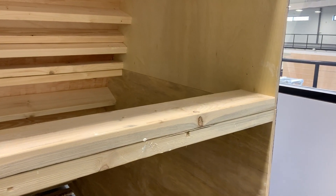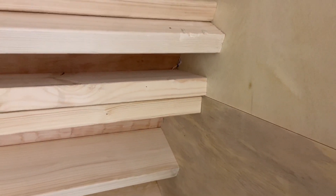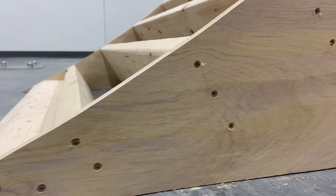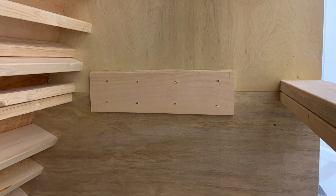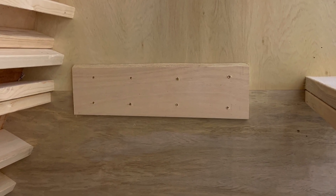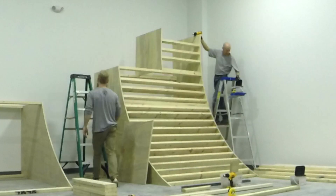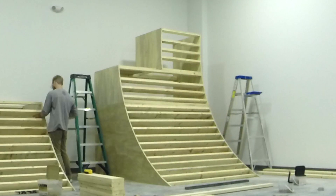To connect the top side walls, screw 2x6 joists flat onto the top of the bottom section, connect the upper side pieces and continue adding joists spaced 6 inches apart along the curve, making sure that the top of the joist is flush with the edges of the plywood side walls. I also like to use a scrap of wood to secure the side walls together at the seams on the inside of the wall. If you're building a multi-height wall, you'll simply cut your joists in half at whatever height you desire, moving one of your side walls to the middle to meet your joists.